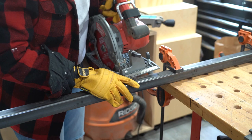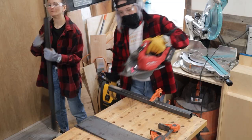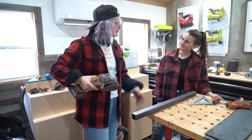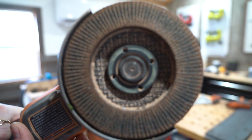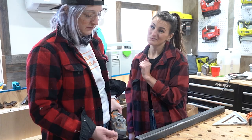These square metal bars are going to eventually be the legs on Sam's new tabletop. First we needed to measure and cut them down using a metal saw blade. Look at that saw cut — it just cuts like butter! We made sparks fly! In order to make a weld, the weld needs a clean surface to stick to. So Danny is going to use a fancy flap disc, which is basically just an abrasive sanding pad, to sand away some of the grossness — technical term — so that the weld has something to stick to later.